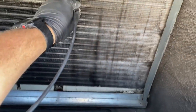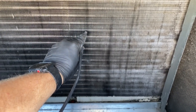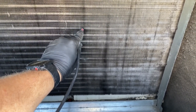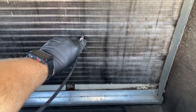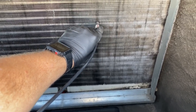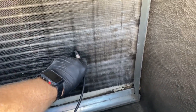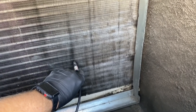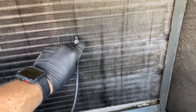I have the H10 Pro Bloodhound and I'm checking the evaporator coil — checking all these streaks on the coil to see if I can find a refrigerant leak. I did find a leak — the H10 Pro went off on one of these oil stains. I did it about three times to confirm. There's the beep now. I pulled it away just to reset it, but yes, I did find a couple of leaks on this coil.